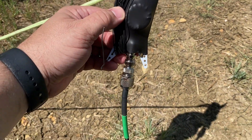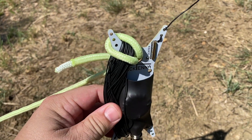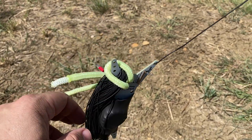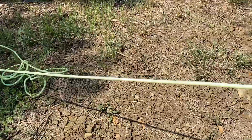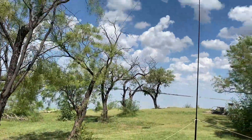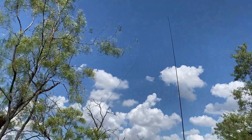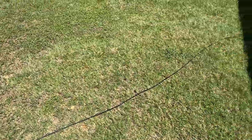Here's the setup. I've got my coax connected there with the adapter, and I just ran a loop of rope and connected to the top of the horn of the board. There's some good strain relief on the element itself. I've got that anchored off to one of my tent stakes, with that wire running all the way up about 25 feet in the air — a really nice sloper setup. Then the coax just runs along the ground to help dissipate some of that energy coming back down.